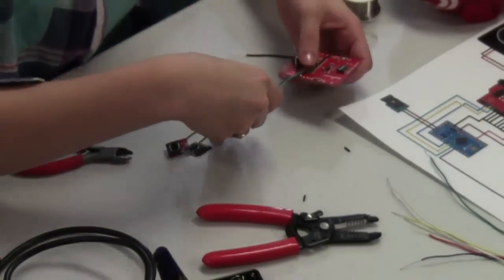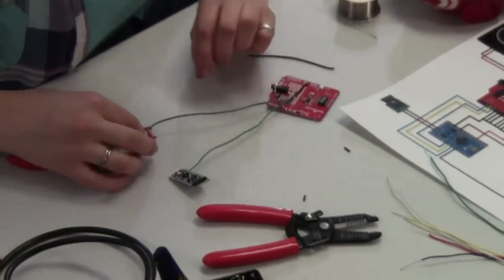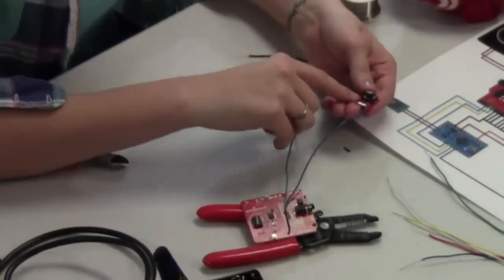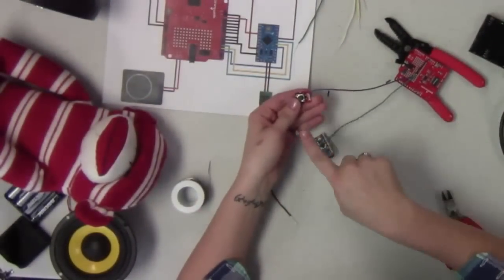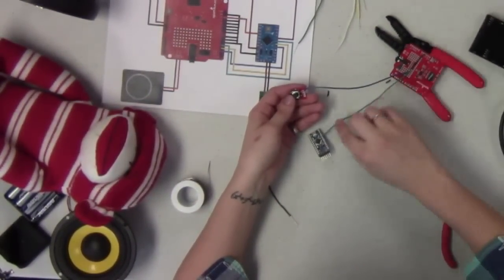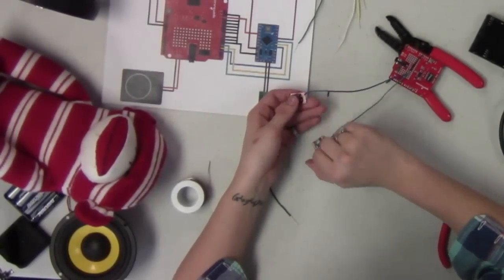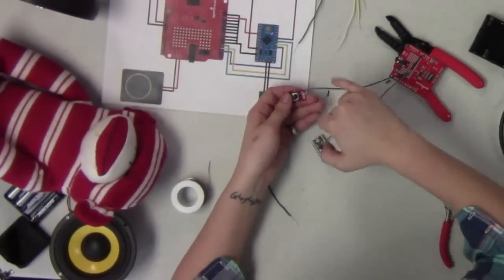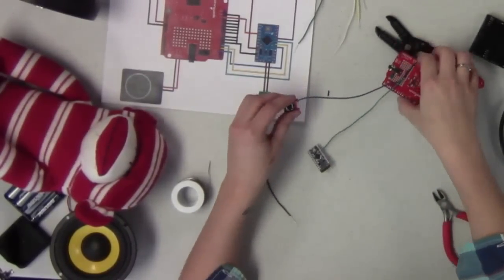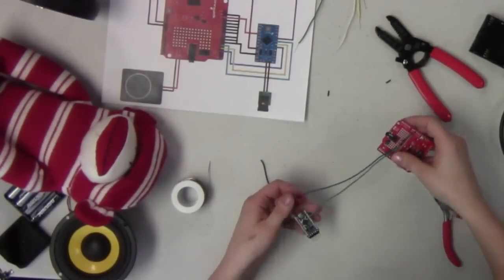All right. So now that we've got that on there, we want to connect the next side of our button. So this, hold that so it's proper for you guys. So with that B1, we have B2 connected here. Remember, that's connecting to our resistor, and then it's also tied to ground and to pin 5 on our Arduino. So now we're going to connect the other side of the button, so that way when we push it, it'll end up shorting them, but we're going to connect the B1 to VCC in this case, which is going to be 5 volts. So we're going to do that now.